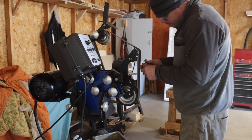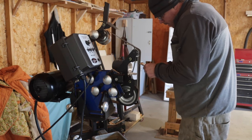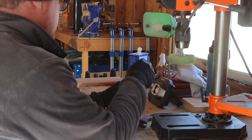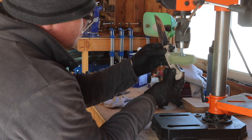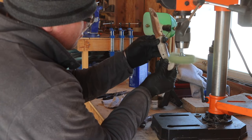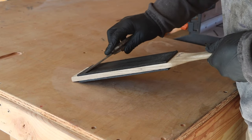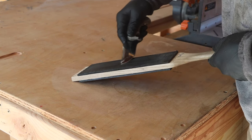Back on the belt grinder for the last time, I put a secondary bevel on at 800 grit. I am almost done. I grabbed a polishing wheel, some green compound, and went to work. I went over the entire knife with this compound and wheel. I then spent a few minutes on the strop getting rid of the wire that was left after the belt grinding session, and finally ready to look at my work.